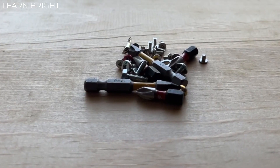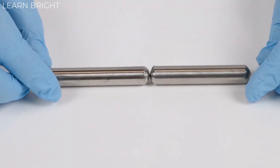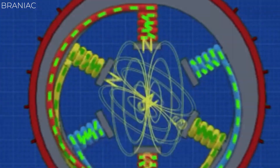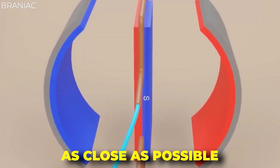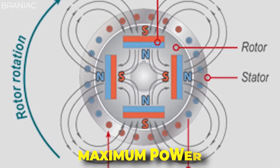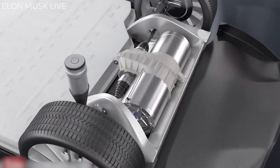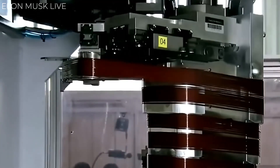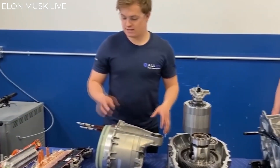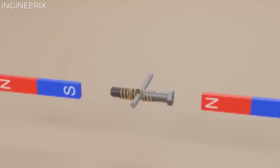Getting back to our own experience playing with magnets, we know that the force of attraction and repulsion between two magnets gets powerful the closer the magnets are to each other. And that force is what spins the rotor, so maximum force happens when the rotor is as close as possible to the stator. But if the rotor is going to expand outwards at maximum power, then we're going to have to broaden the gap to account for that expansion. If the carbon fiber wrap is averting the rotor from expanding, then we can keep the gap much smaller — we're thinking about microns here. This is a tiny measurement, but it makes a difference to squeezing the absolute highest performance out of your motor.